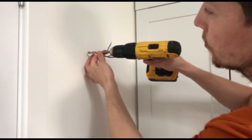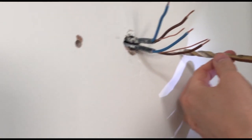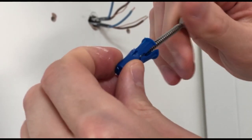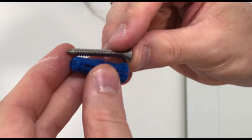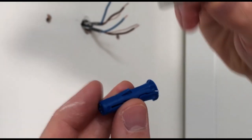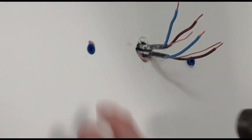Now I've stripped the cables, I'm going to drill the holes right in the centre of the oval shapes marked out. I've got an 8mm drill bit for the 8mm wall plugs. It's just a plasterboard wall so there's nothing behind it. For the wall plugs, choose a screw that matches the wall plug well so it expands correctly. With plasterboard you want it to expand as close to the front as possible. Then push the wall plug through and tap it with a hammer - not too hard - until it's nice and flush with the wall.